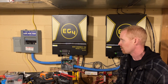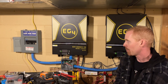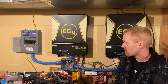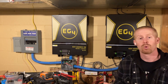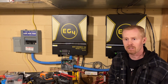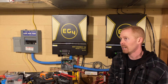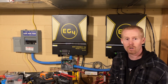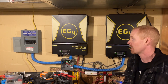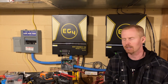Trying to run all that four-gauge wire in there, it's really getting tight - along the same reasons as the one-inch conduit, it's just getting very tight to work with. So I might end up having to upgrade to a larger panel. Right now it's a six-slot, so even a twelve-slot - doubling it in size - might give me enough space. It's something I'll have to consider within the next short amount of time, definitely before I go and hook in the AC output, because there's just not a lot of room in there right now.